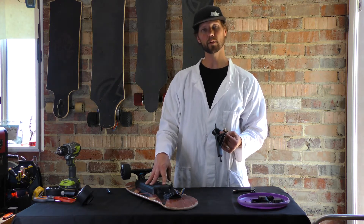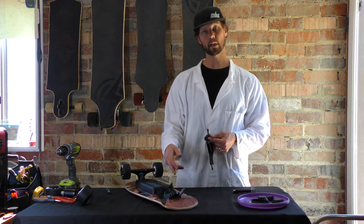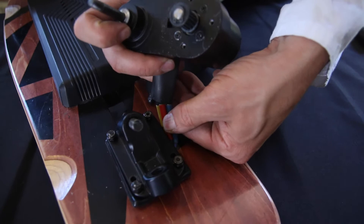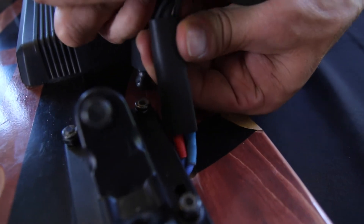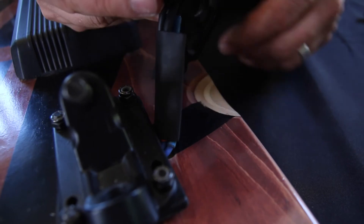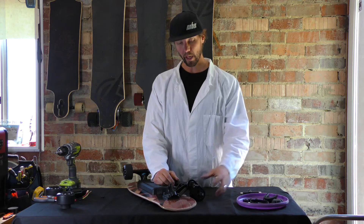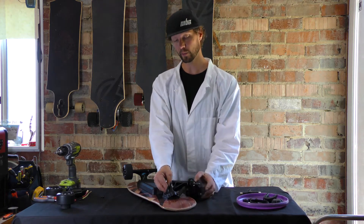On single drive boards, it's actually pretty easy to do this because it doesn't matter what order you put these wires in - you can just make any random connection for the three wires. Make sure these guys are in nice and firm. Then you're just going to wiggle and slide your heat shrink tubing down over the connection to where it's nice and evenly covering both sides. Don't heat shrink it quite yet - we're going to get our assembly back together and do that as the last step.